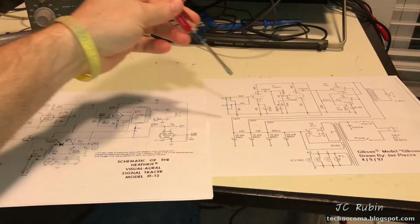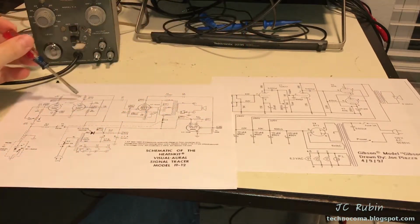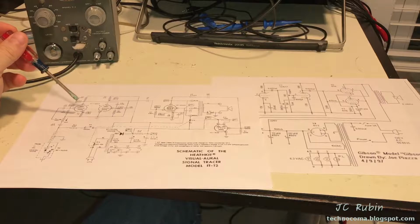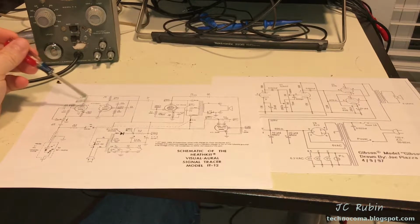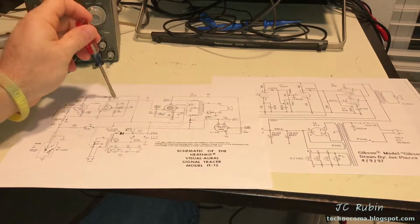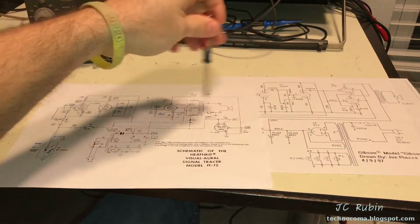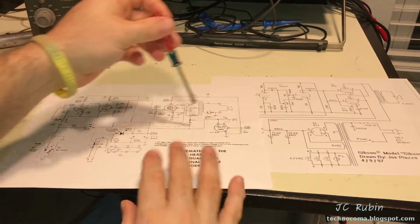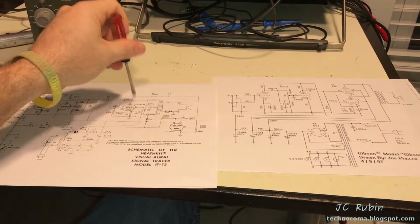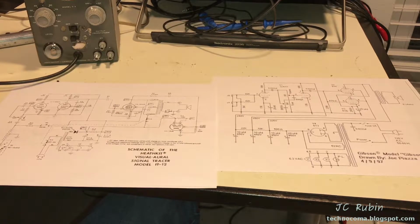The only thing that I want to do is more closely match the characteristics for this portion of the 12AX7 for the voltages on the plates, right? That's a consideration I want to do, because I want the 12AX7 to operate like it would in the Gibsonette, as it will in the Heathkit, right? So I'm going to be making some voltage modifications to that so that they run the same. And then I'll worry about the second half. So I'll have that other one coming across here, that the voltage isn't dropped, that would make its way to the finals. I probably won't be modifying that, because the beam power tube is set up to operate as the beam power tube should. So these are things that I have already gone through.